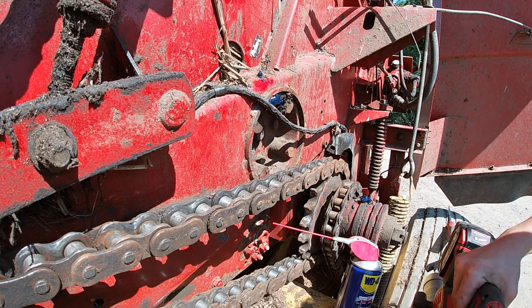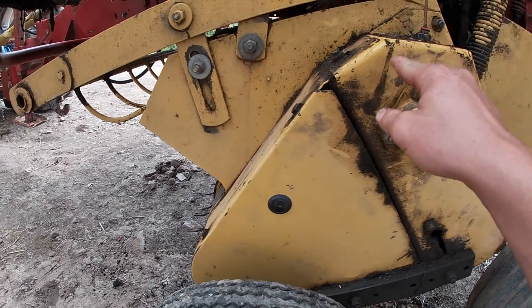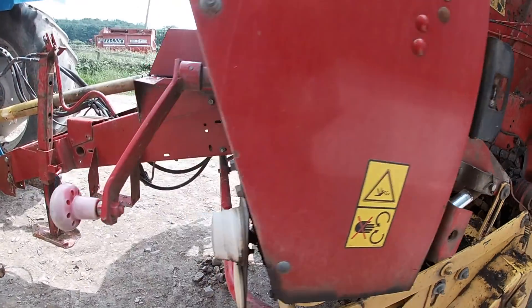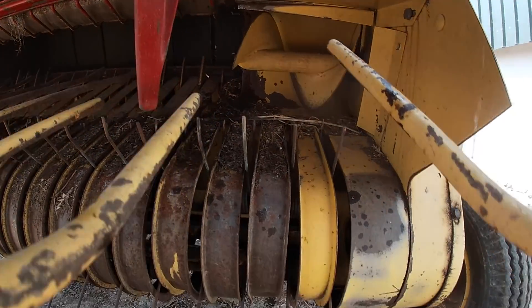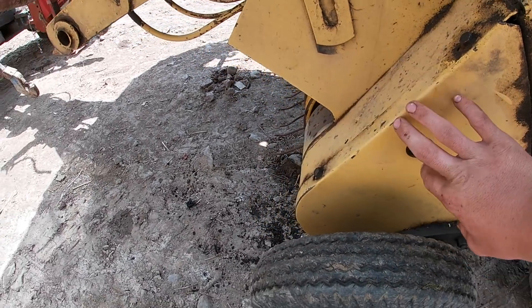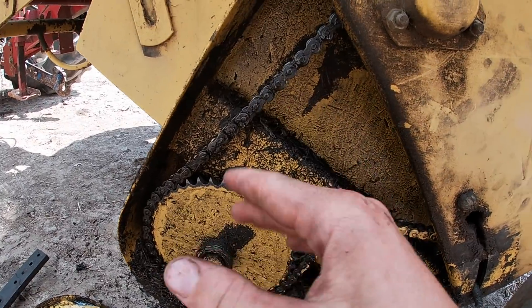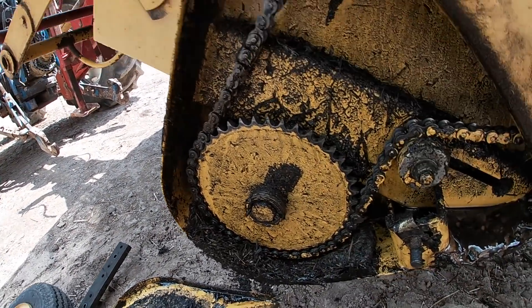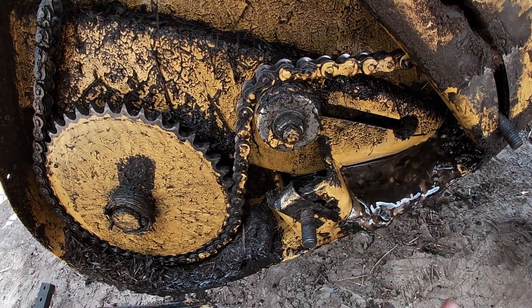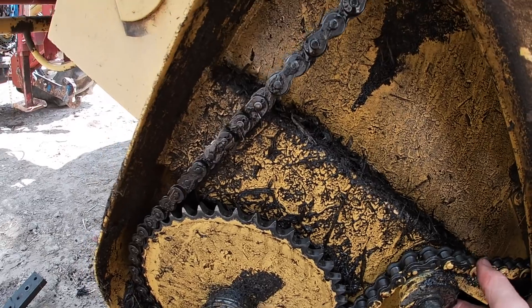Grease is coming out of that one now. Wipe them off and just pump a bit of grease into these. Next up we've got these side guards to take off. In here is just a set of chains which runs the pickup reel and also the side augers. All the side augers do is when crop is coming in at the side of the bed, they throw it into the flow of the chamber. Drop the wheels off, a couple of pins out, and then it just comes out of the way. There's the side guard out, and you can see in here it's really well oiled — there's an oiler that drops in just there. But this chain is rather slack, so I'm going to undo the pin, push that adjuster that way a little bit, and that will tighten the chain up. Look — the chain is a lot tighter now.